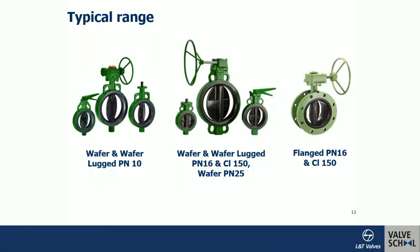The typical pressure range includes PN10, PN16, class 150, and PN25. The wafer design has no flange attached — it goes between pipe flanges in the line. It can be easily positioned using a lifting hole. The valve should be kept in the closed position before installation. Instead of double bolting as with a normal flange, the wafer design requires only a single long stud and nut. The double-flange design and the wafer-lug design — where all holes are present but the material between holes is removed — were developed to reduce weight.